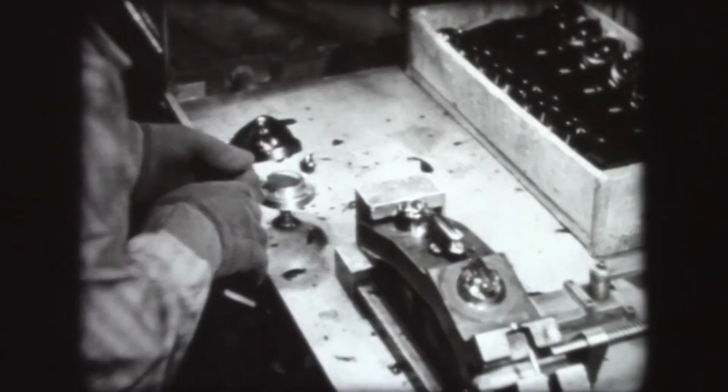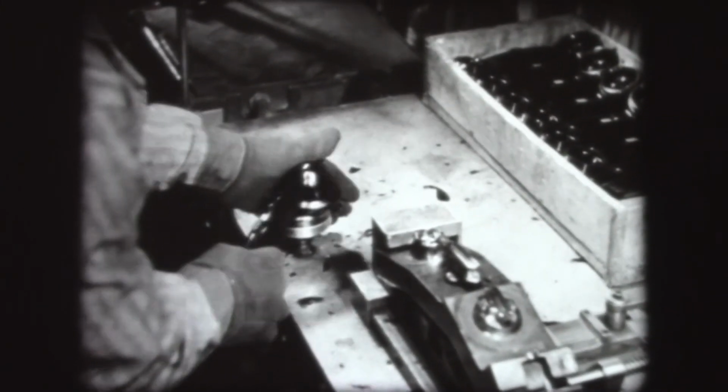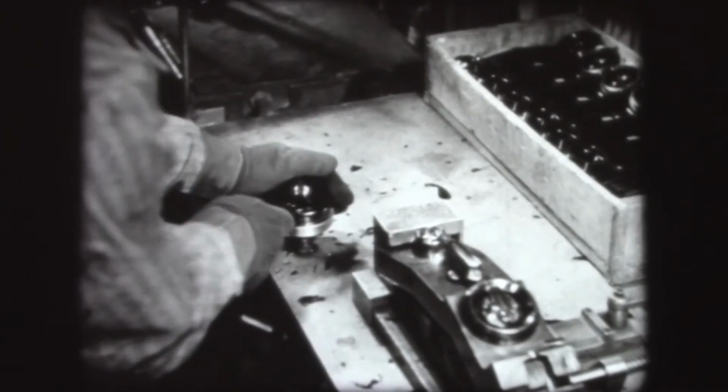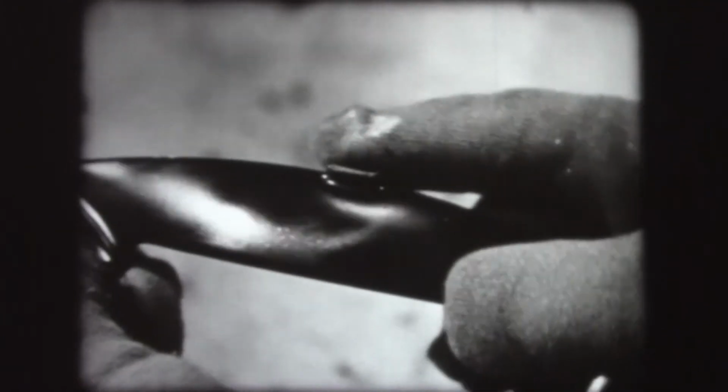Many plastic pieces that are made by molding must undergo several finishing operations before they are ready for service. On this telephone handset, for example, the gate must be cut off and smoothed out to the contour of the piece. The threaded metal inserts retapped to clear off all plastic material, all overflow plastic or flash filed and sanded off, and the curved contour of the piece maintained. The parting line buffed off, and the entire piece polished to a glossy finish.